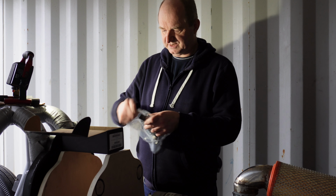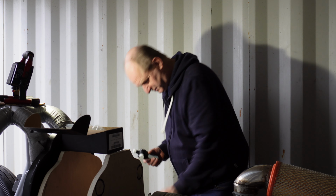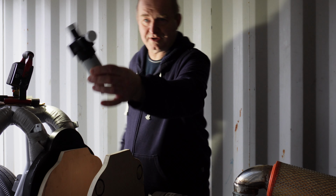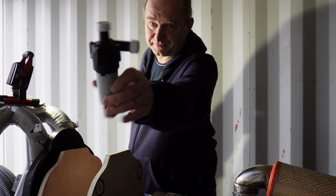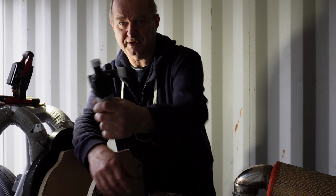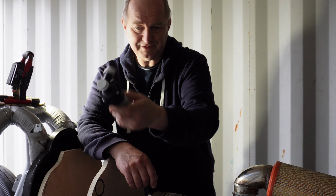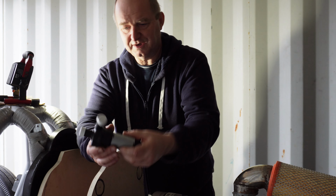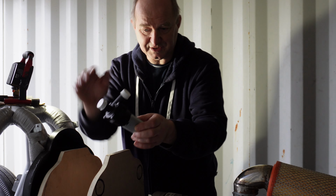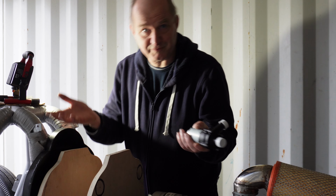So to do that, I need an electric... I've lost them off the seams. There we are. Lost them again. Never mind. You need an electric water pump, and you can see this is from, I think, a Volkswagen. When you park your car, a modern car, you'll hear a little buzzing and the fan will still be going, and what happens is these will pump a little bit of water around the engine just as it's cooling down, especially if it's got a turbocharger or something like that, so I've been told.